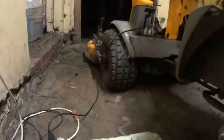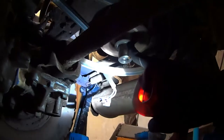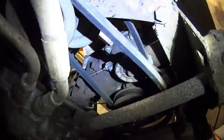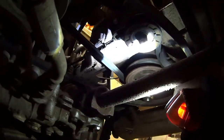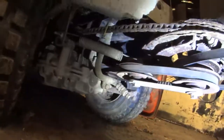It's not like drive shafts and different things. Let me get my light. Over here there's two. I removed the mowing clutch that was here that was making noises. This is the crank axle from the engine. The belt above here is for the drive — to move around. It goes to the hydro pump and then it sends hydro fluids through these hoses to the hydro drive.